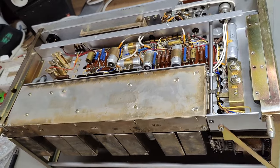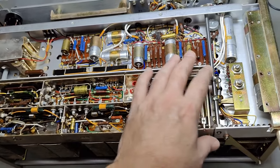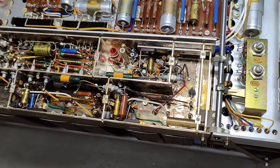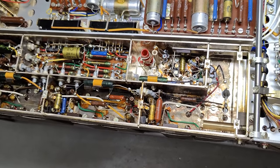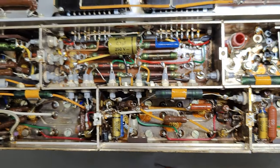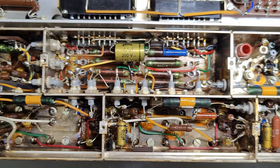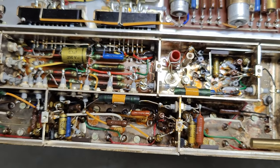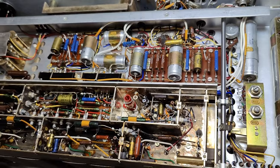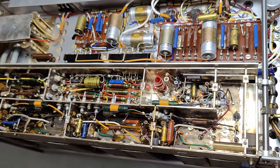I really want to open the IF section and have a look. I think we should do that - you're going to love this. So this is of course the entire IF section. When I'm changing IF bandwidth, see what's going on here. This was definitely from a time where relays were not a wanted solution. You could have added tiny little relays, but probably this will last a lot longer.